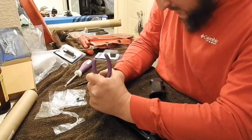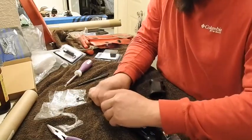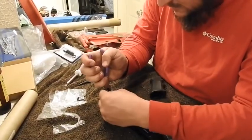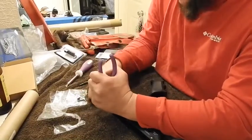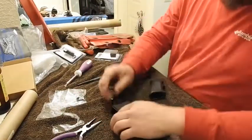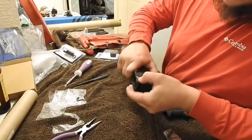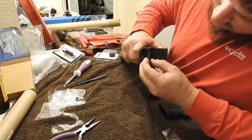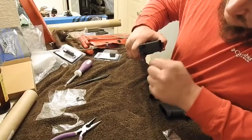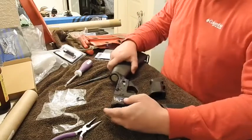That spring is under a load. Our orientation is correct. This is what you don't see when other guys put them together really quick — they probably tried it seven or eight times and picked out the shot that was perfect. You're going to fight this. To remove it, there's a hole right here — you put a needle inside, push the detent down, rotate the pin, slide it out, and it all comes apart. We got it.